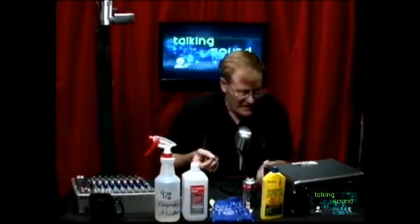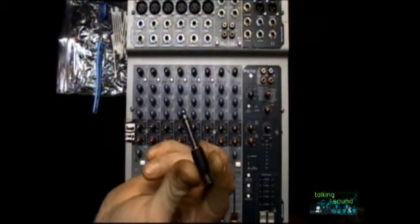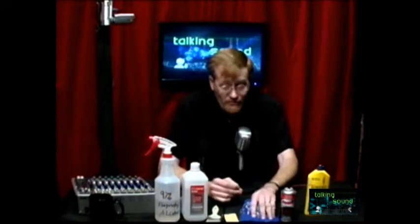One of the other items I keep here is an input tip — just a standard quarter-inch input. We'll be going over quarter-inch cleaning today. I also have an XLR tip and an RCA tip. These tips are basically what we're going to use as quote-unquote dummy loads — to mock up actually plugging in and out a cable — so that the contact points on the inside of the mixer that actually connect to the tips will be able to properly connect without any corrosion getting in the way.